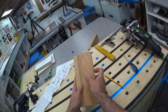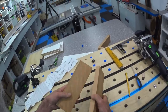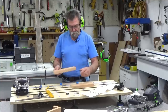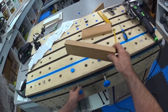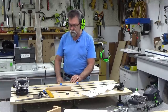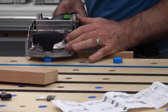Now the next thing to do — to save any confusion, I open it up and I've actually put a little elliptical shape there and there, so I know where that plunge has got to go in. On this one I've got to go in that way, and all the writing that I've done has got to be facing up towards me. On this one I want to go there, so I'll pull my supports out a little bit. I'll be sitting it there and doing a plunge, plunge, plunge. Working off the sides, these ones need to go in 15 millimeters deep with a minimum of 10 in the depth.